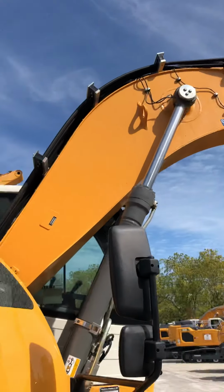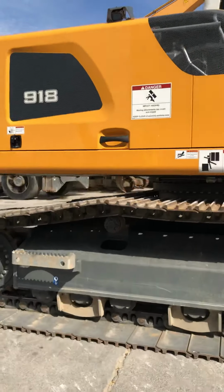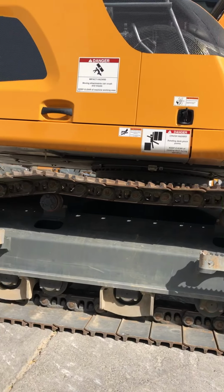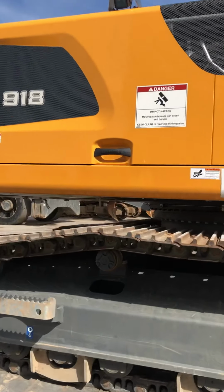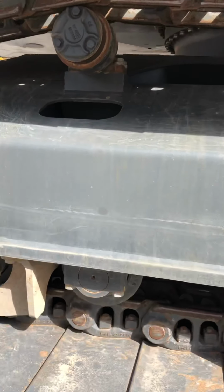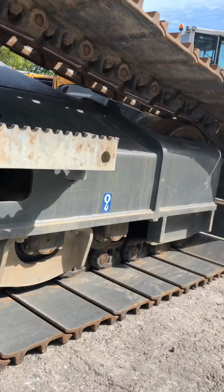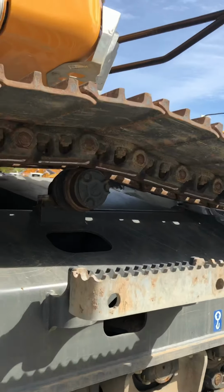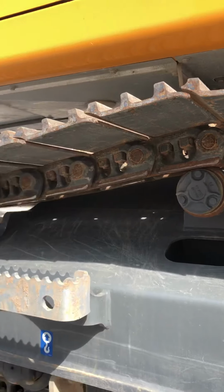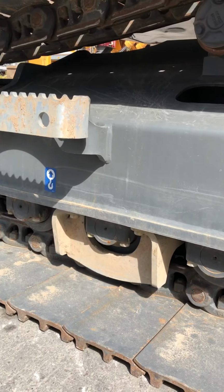On the side of this machine, you'll see the undercarriage. If we look underneath the undercarriage, you'll see 3 holes. The hole in the center is a big hole. It's just underneath the tracks. The mud falls through this machine very easily, so the operator doesn't have to shovel as much. It's on a large angle, so the mud runs off easier. And there are holes underneath the idlers, the chain carriers, so the mud falls through and onto the ground again.